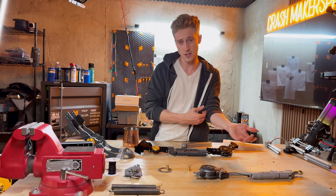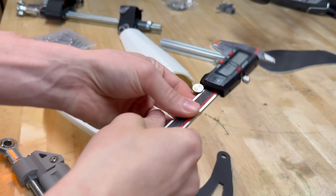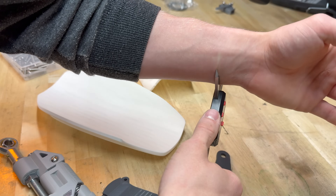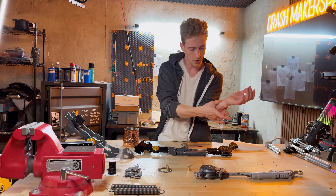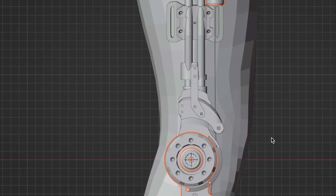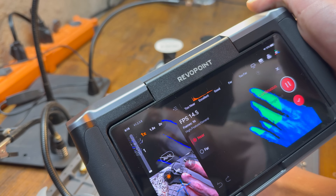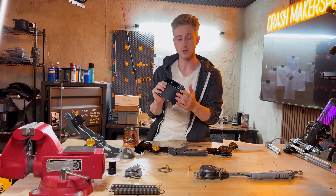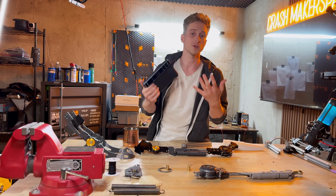It's pretty hard to replicate these joint structures in a dimensionally accurate way digitally. You can't use traditional measuring methods like a tape measure to recreate this for modeling — you'd have to create the file multiple times across different positions, taking a ton of time and still inevitably being inaccurate. That's where the beauty of a 3D scanner comes in, because you can scan these organic models at each position and get a very precise model you can trust and build your system around.